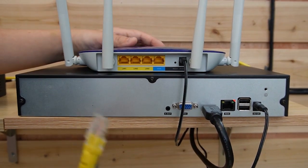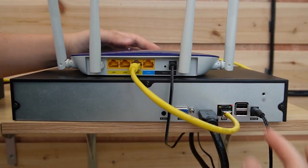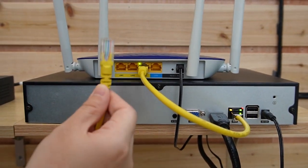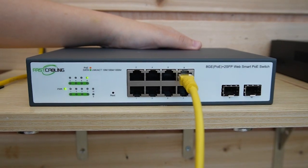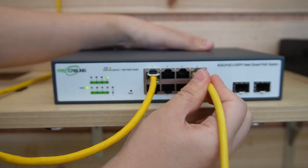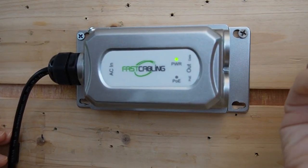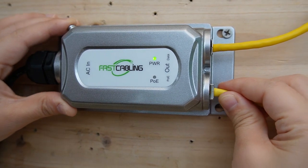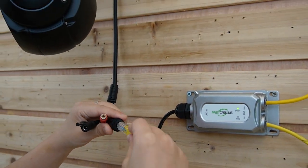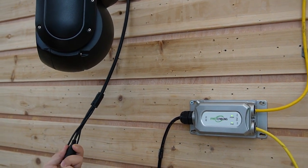So now we are going to do the connection together. First, we'll need a router to provide main network data. I'm going to connect it to the NVR first, and the NVR is already connected to the monitor. Next, I'm going to use another short patch cord to connect the router to our WebSmart PoE switch to provide data. Since we're connecting to one PTZ camera, I'm going to plug in one ethernet cable. Let's come over to our outdoor PoE injector — as you can see, it's already powered up. Now I'm going to plug in the ethernet cable from the router, and use another ethernet cable to connect the injector to the PTZ camera. The indicator light is on, and now the PTZ camera is getting power and data at the same time.